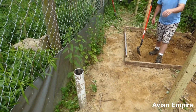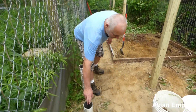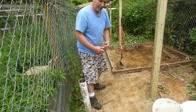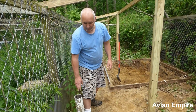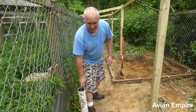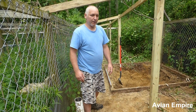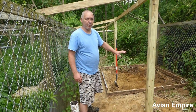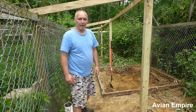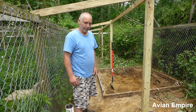We've got the drain pipe going right over in front of me — it's going to be connected into this. We kind of screwed up because the drain pipe should have been longer, but this is a clean-out and I'm going to put a 45 up to this pond here. We use 4-inch sanitary piping to take the waste away, and we will use 2-inch PVC schedule 40 PVC pipe to go up into the pond.